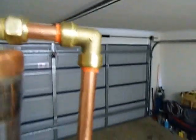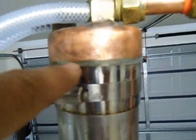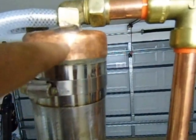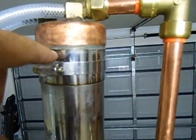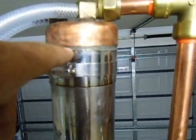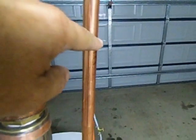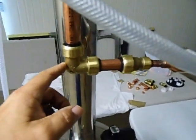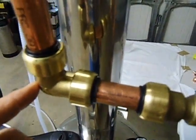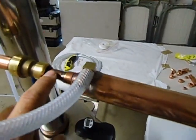That goes right on top there, right to the top. So that comes straight out right at the top end. It's also got another copper plate that's been welded on the inside, just about one and a half inches below the actual outlet. It prevents the vapor from going up straight into the tube and acts like a baffle or plate so condensation can't go straight up into it. So that's where the vapor is going to come out — it runs all the way down in this copper tubing, all the way to the bottom. Here I've got another elbow, and then a joint — it reduces from three quarter inch to half inch. That's the inlet of the condenser where the vapor goes in, and then it will start cooling down as it goes through.